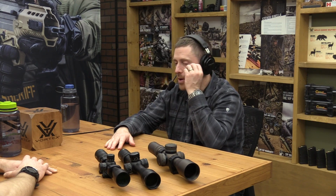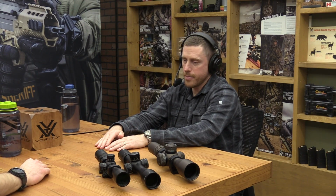Yep. And isn't your most ideal optical image usually when the erector unit is nice and straight? It is, yeah. So if you have to be jammed way over to one side, chances are you might have some actual optical issues, or it might even be a little bit harder to get behind the scope and get a really good image and eye relief, because it might be a little more critical since you've got the erector jammed all the way over to one side. Yeah, we try to design that stuff out, and you can, but obviously it takes more expertise and expense to do it. Our engineers try to design that out of the system.